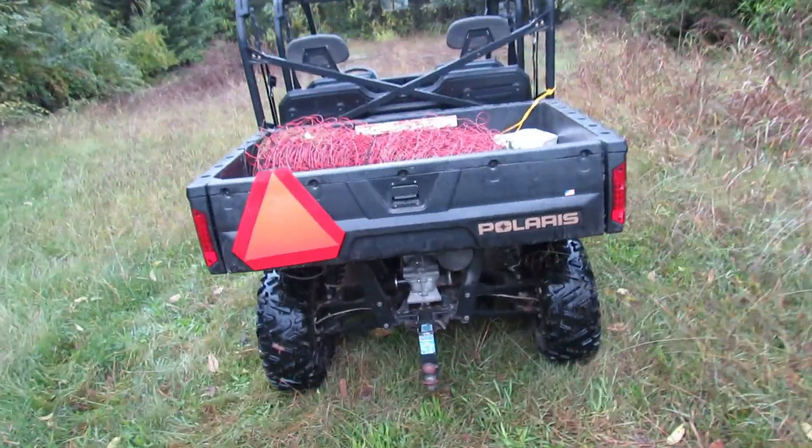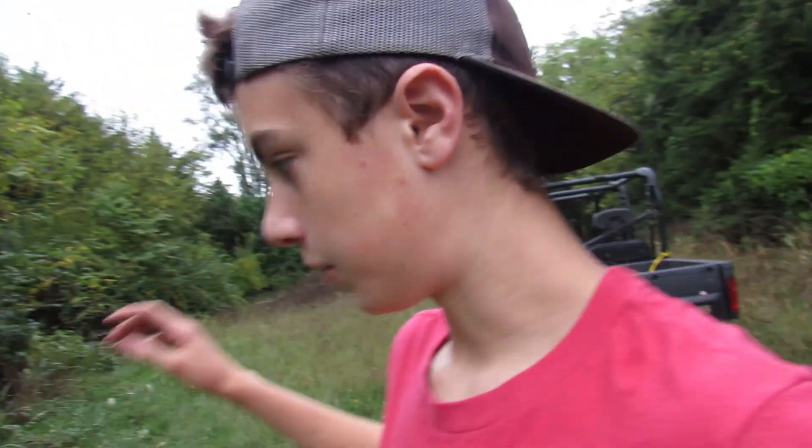Got them both here. I did roll the third one up in the back — if we don't need it, I'm just going to take it up to the barn and set it in the attic, but if we do need it then I'll have to unroll it. Now I just got to get the mower and clear a straight path for the fence to go in, because if not it's going to touch all this tall grass right here and the electric is not going to work — it's just going to get grounded out the whole time.